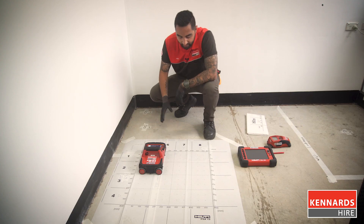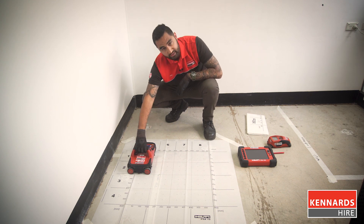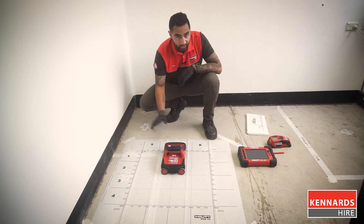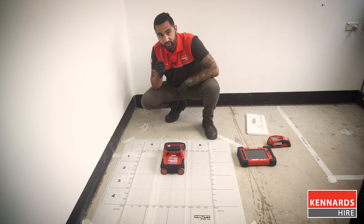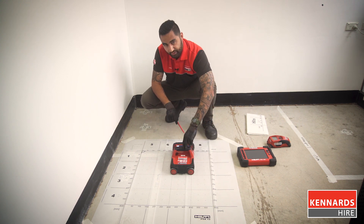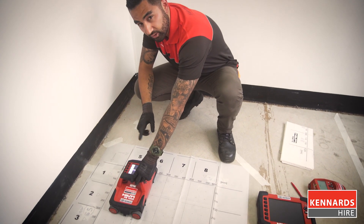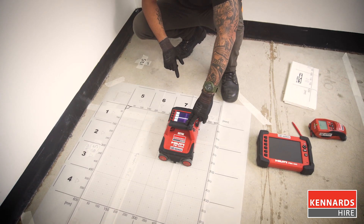Basically, it operates the same way — it's just got a little bit of a bigger footprint, although it's just your side-to-side motion. Like I said before, you can use it like the PS50 with your crayons, marking out where you think that rebar is on your screen. You also get a lot more detail with the visual feedback of the unit, and it actually saves the scan data, so later you can upload that to your PC and generate your PDF reports.